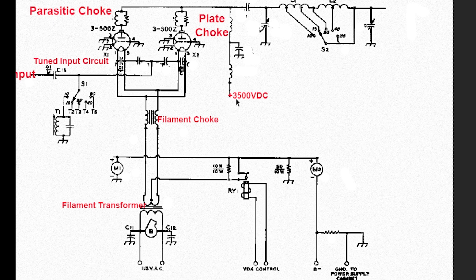The DC voltage — so this is common mode, it's got DC on it and RF on it. To keep the DC from going to the tank circuit, there's a capacitor called a doorknob capacitor — I'll show you what one of those looks like. This is sort of an antenna tuner: we've got the tank circuit, a variable capacitor called the plate tune capacitor, and a load capacitor or load control. The output of the tube comes out here. The idea of this antenna tuner is to take the high impedance of the tubes and bring it down to 50 ohms, or something close to that.